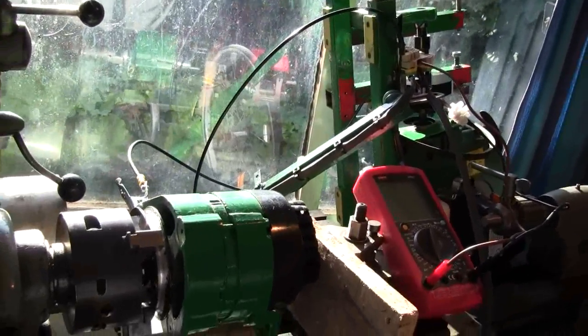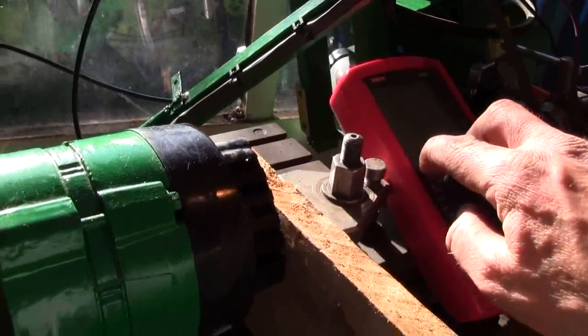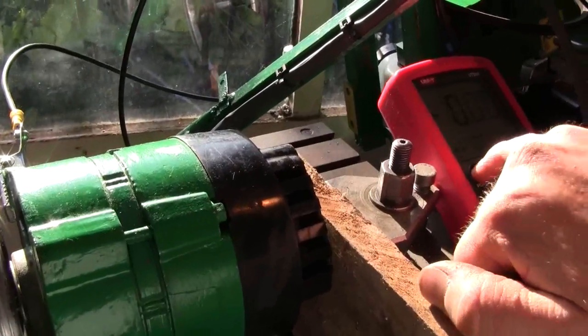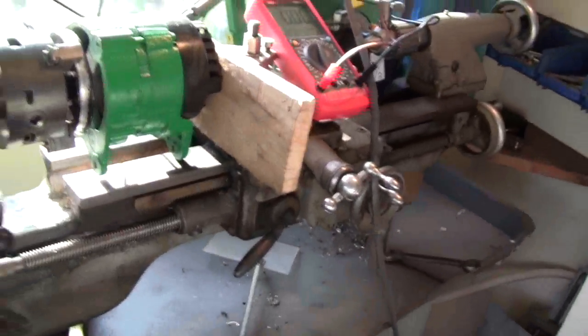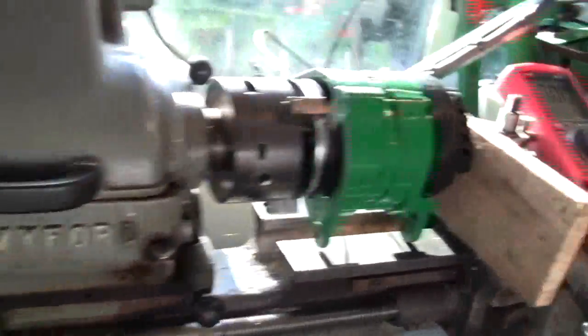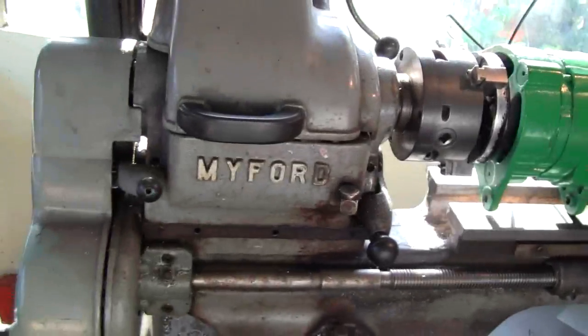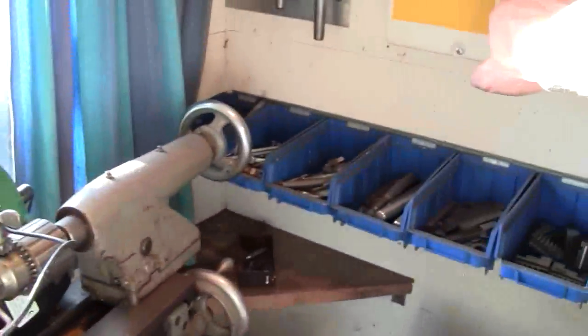What I'll do first is show you the current — I'll put my ammeter on and start it up. I've got it connected to my electric bike, which gives quite a good variable load for experimenting. I think you'll find when I put about 10 amps, or perhaps 10 and a half amps, load on the alternator it'll actually trip the thermal overload on the lathe control panel, because that's really too much load for it. So I'll give it a run — start the lathe and press start.